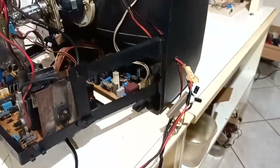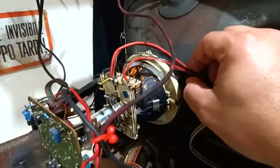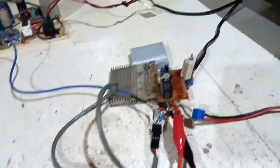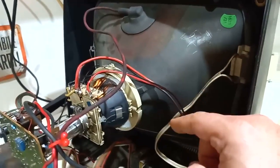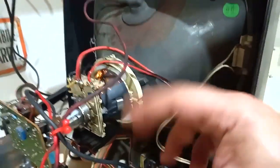The basic concept of an oscillograph TV is that you open the TV, disconnect the wires that go from the main circuit to the deflection coil, and connect the deflection coil to a stereo audio power amplifier. This way you can drive the deflection coil and deflect the electron beam on the screen to make graphics with sine waves, music, etc.